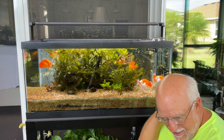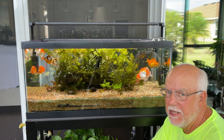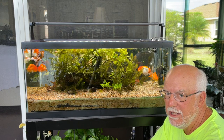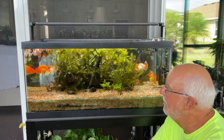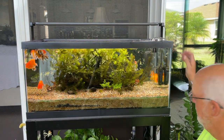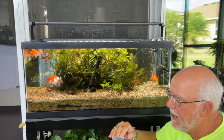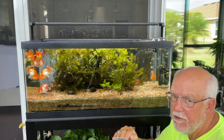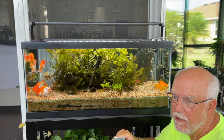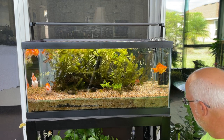The project itself, 1.5 hours. If you had a machine shop, it would take you only minutes to cut it and machine it square. Basically, the part that took the longest was making sure, because I used a file, that after it was cut, I had to file both pieces together to make sure they're both the same height. And that took the longest, the filing to make sure it was square again. Other than that, though, it was a pretty easy project.